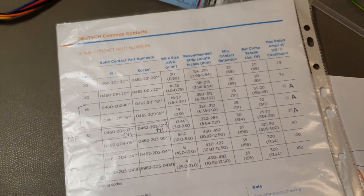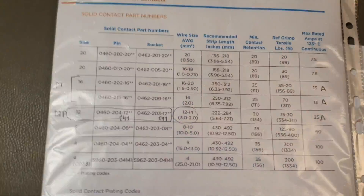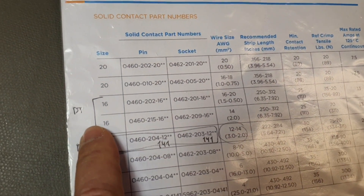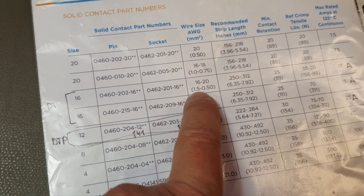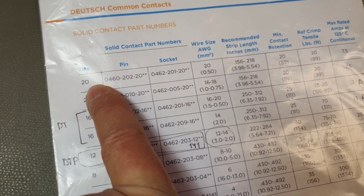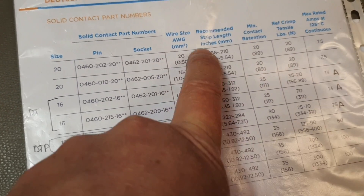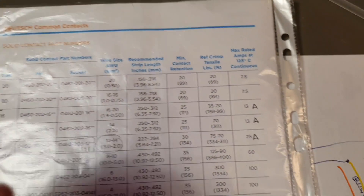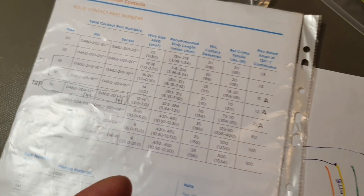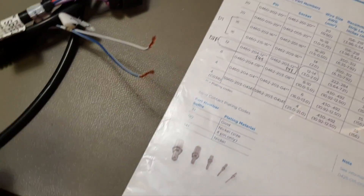Let me reveal immediately why DTM is a kind of useless. You should watch my previous video if you don't understand what this table is about - it's about contacts. In DT you have contacts with size 16, in DTP size 12 and others, and in DTM you have contact size 20. These contacts cover gauge 20 from 16 to 18 - the same range covered by DT contacts. Why do you need DTM if they cover the same range of cables with less current capacity? In my opinion the only reason is smaller size.